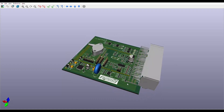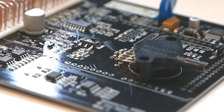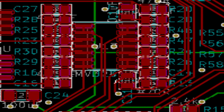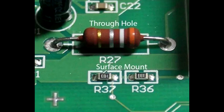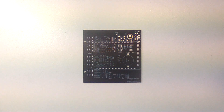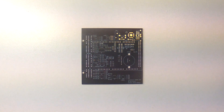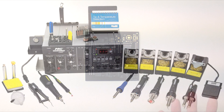As the name suggests, surface mount electronics are components that sit on top of a PCB rather than the more traditional through-hole components that are passed through the board. Compared to through-hole components, surface mount not only allows for much more circuitry to be used on a single board due to the smaller size, but increasingly there are a lot of parts that are only available as surface mount components. The problem though is that there's a slightly higher barrier to entry, and I think a lot of people are nervous about it or think that you need expensive gear to assemble a surface mount board.